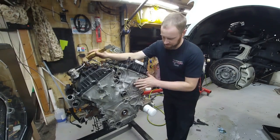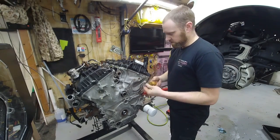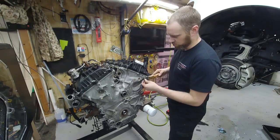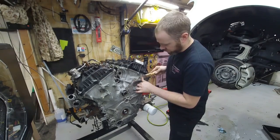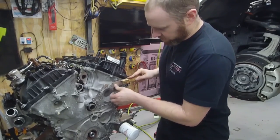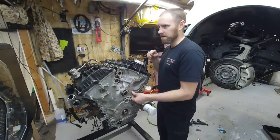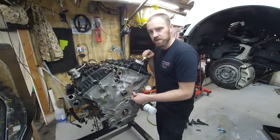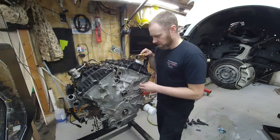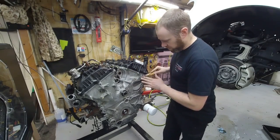We need to address this corrosion, and the best thing to do to clean it is use something like a super scraper — I've talked about this many times, link in the description as usual. The super scraper does an excellent job at cleaning things like this up and you can see it's just peeling it right off. That little section was probably ten or fifteen thousandths of an inch thick in a couple areas — pretty darn thick — so considering that it just plowed it off like nothing is pretty awesome.